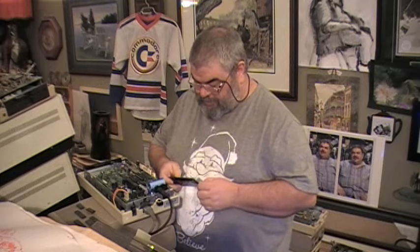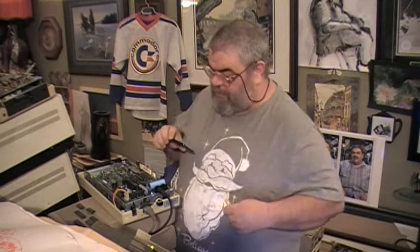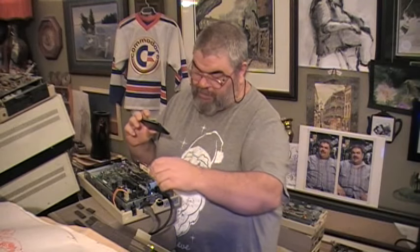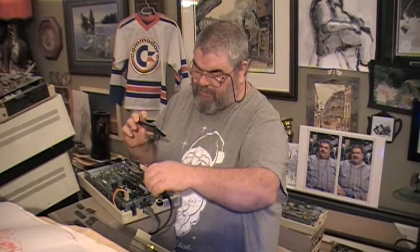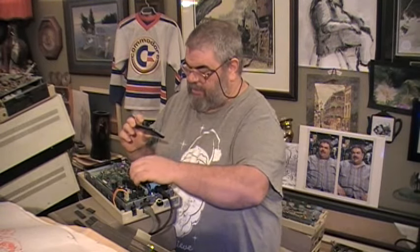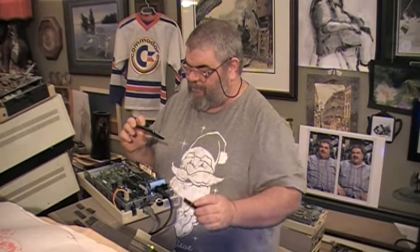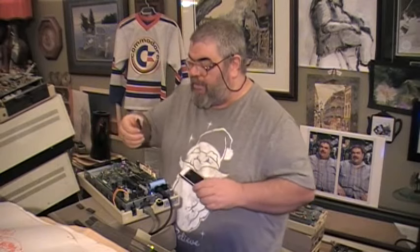So now, we'll turn this off, and we will grab the iPod Touch. And we'll see if we can't do a quick video of a chip removal. So here we are. We're going for the 6522. Careful not to hurt the capacitor. I give a gentle pry on top of the ROM chip, and then pry gently down. This one looks like it's gonna go okay. I gently rock and roll. Aha. 6522. And I will put that with the 6502 that just came out.